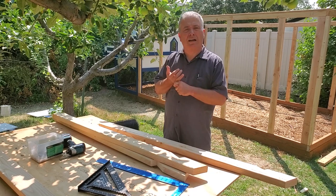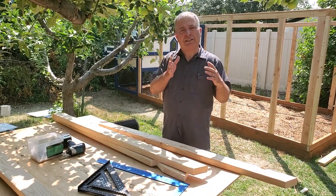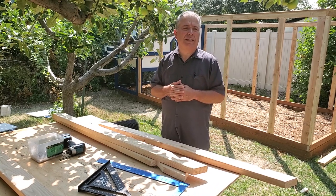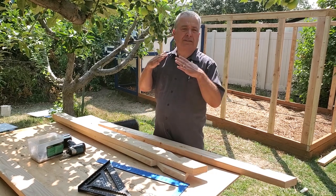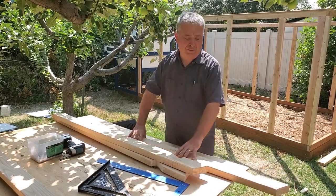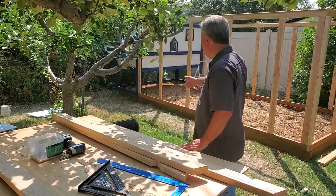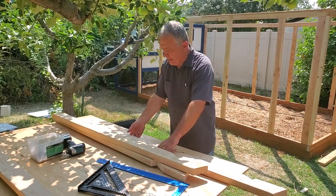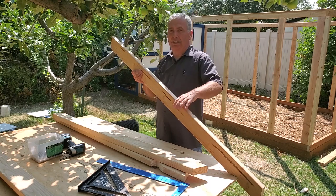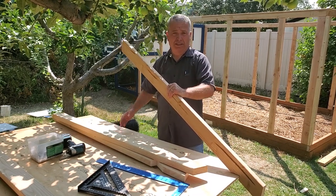I'm copying my coop off of Carolina Coops, but I'm specifically following Lazy Lab Acres and the way he built his coop on his YouTube channel. On his roof, he says he did a 5/12 pitch. And what a 5/12 pitch means is, like, my width of my structure is 8 feet, so I know the truss is going to cover half of that distance, which is 48 inches.